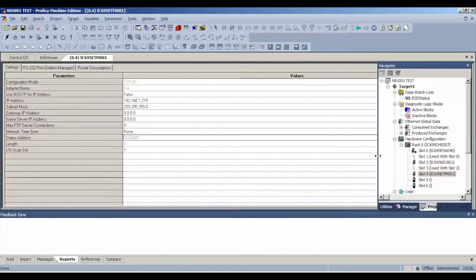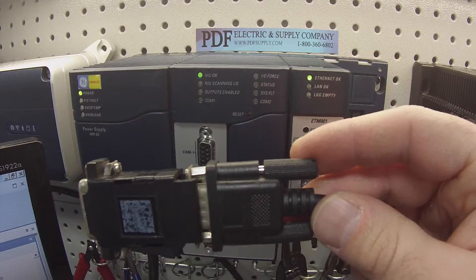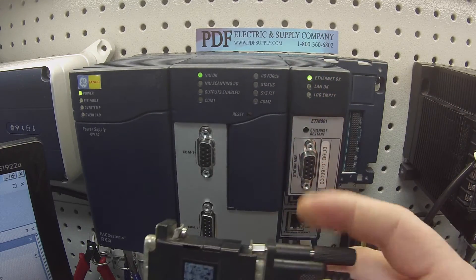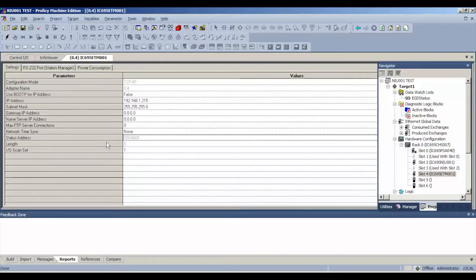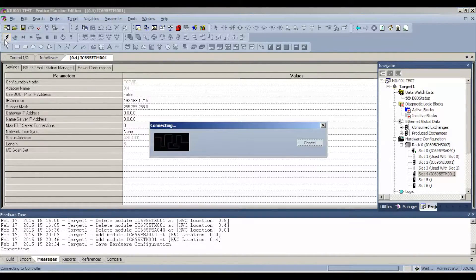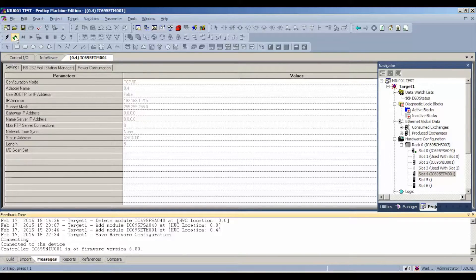Those red asterisks are telling you that you haven't set up your IP addresses yet. Moving on — the first thing I want to do is connect up to it. I'm going to do that by using an HE693CBL232, and the adapter I'm using to go from 9 to 15 pins is an HE693SNP232. I'm going to go to the lightning bolt icon, same as I would with a CPU. Once it's connected, I'm going to hit the green hand print. Notice down below we see the same thing as with processors: programmer mode, stop disabled, configuration not equal, logic not equal. This processor hasn't been in service, so this is all new information — it needs to be downloaded.